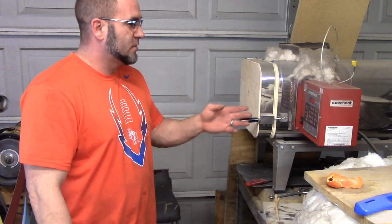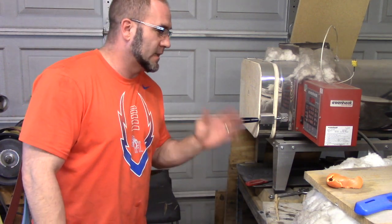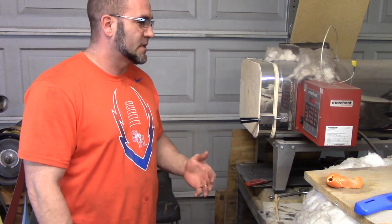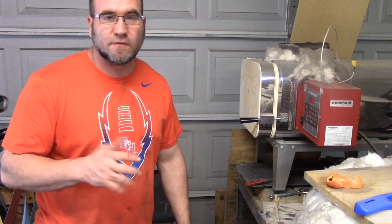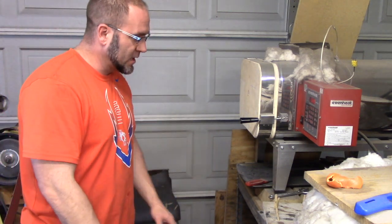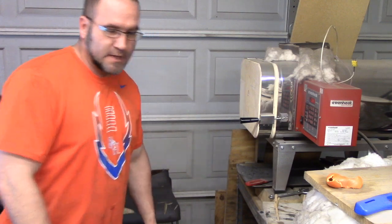So I'm going to take a few minutes here to let the oven come back up to 1500. And as soon as it does, I'm going to hit start on my timer for 7 minutes, and I'm going to let it soak for 7 minutes. And then we're going to quench it here, and I'll show you what I'm using for that.